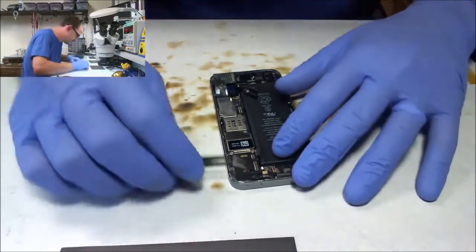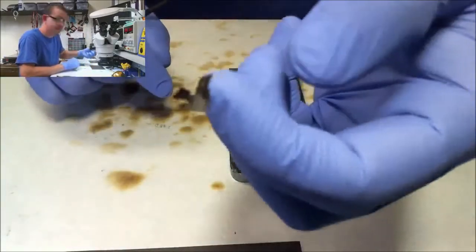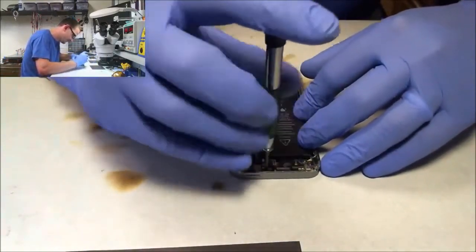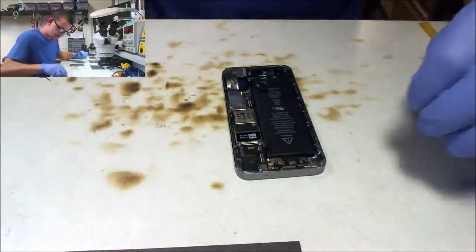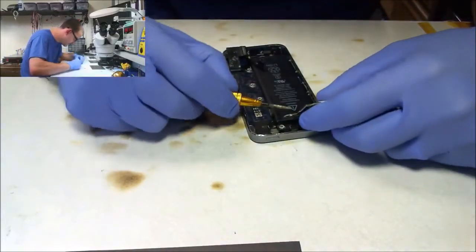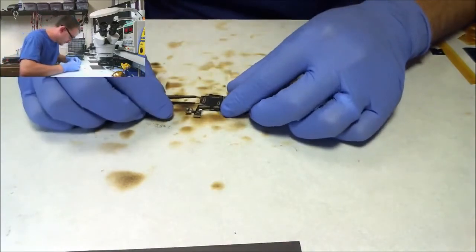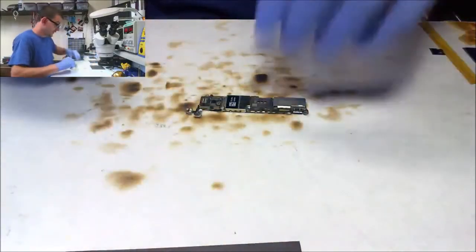And there's going to be a screw in the top, right in the middle, hidden by this little sticker. Gosh, Apple almost tricked me with the sticker. I could have forgot that screw and tore the top of the circuit board off. All right, flip it over and pull the Wi-Fi antenna cable off without breaking it. Remove this little sticker because it's in my fucking way.